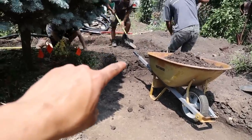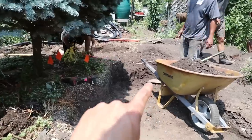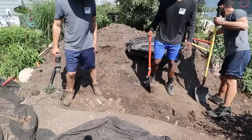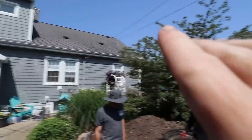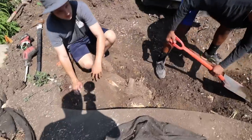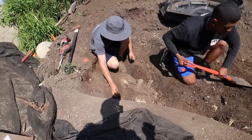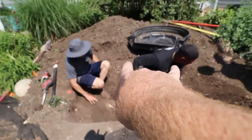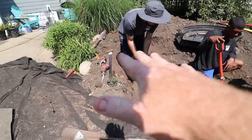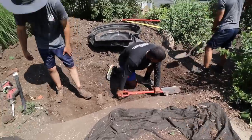We made some changes - we moved the waterfall to over here instead of back there. That was because of viewing angles and the slope. You're going to see it every time you cross over this bridge. The biggest obstacle is there used to be a giant locust tree here - branches went out over the garage and covered this whole patio. We're finding the remains. Matt, David, and Tyler have been picking at this thing. We're planning on just smoothing it out - as long as I can get things flat by the base of the Bio Falls and stack my boulders, I'll beach this section out and let gravel roll back in. It'll be kind of a birdbath type area. Tyler's shaving this down to about six inches lower than the top of the patio so no matter how much water backs up, the edges will still be good.